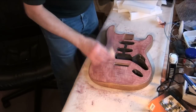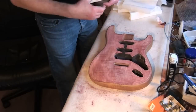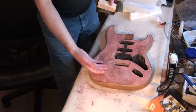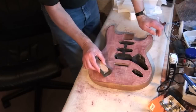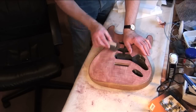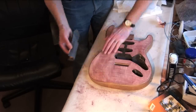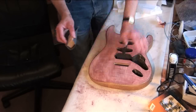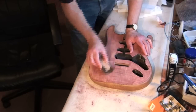I've actually damped the surface of the grain slightly, which as well as bringing the grain out a little bit for your benefit, also brings the surface grain up on the wood. So as I rub it back down again with this 1000 grade wet or dry paper, it will get very much smoother when it dries out. It also means that when I apply the next layer of wood dye it will tend to go on more evenly, which is important as the next layer is going to be a colour wash that I want to remain in place.